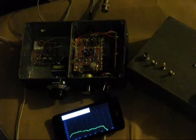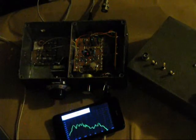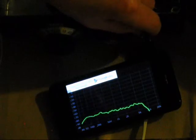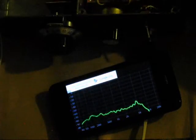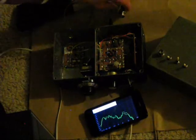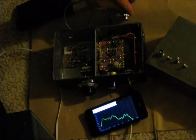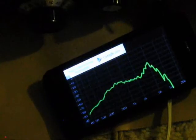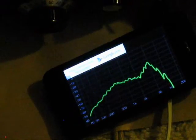We're now going to run a series of tests. First of all, internal noise. The receiver is off, the gain is set to full, and I'll turn the receiver on. That's the receiver on, and that's the receiver off. So the receiver has very little internal noise. Next, we'll connect the antenna — just watch what happens on the phone. Now the noise has gone up to minus 60 on the display, so there's clearly adequate sensitivity for my noise level, which admittedly here is quite high.